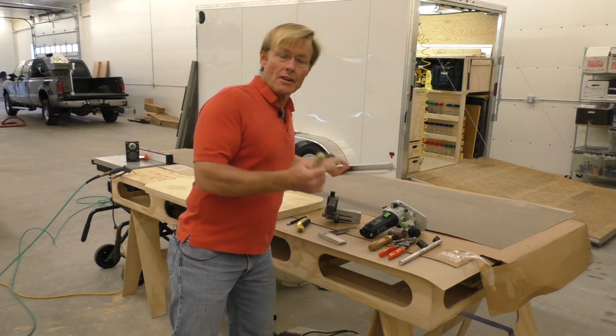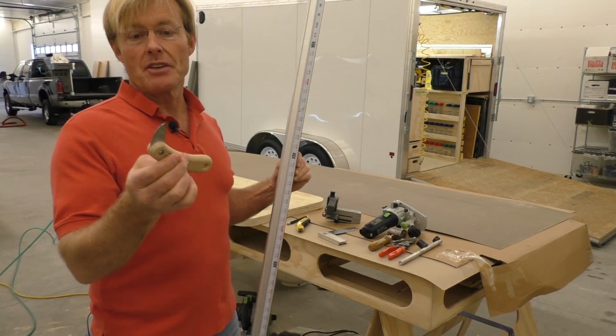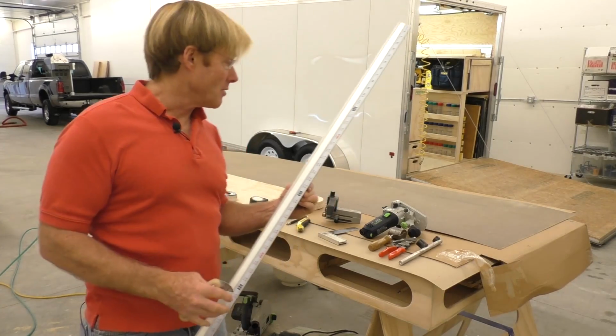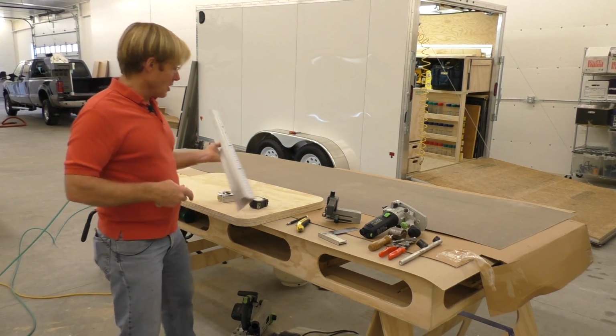One way, a tool that everybody needs, it's a pretty inexpensive tool. It's just a laminate cutter. It just has a carbide tip on it, and you just score the laminate with a straight edge, and then you break it off. And that's how I'll do the rectangular piece. I'll cut straight across with that.